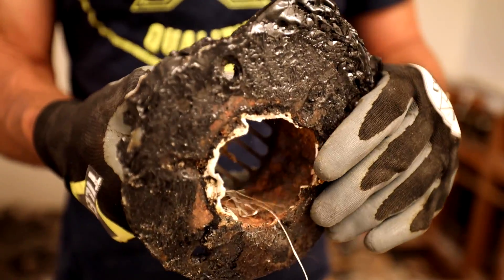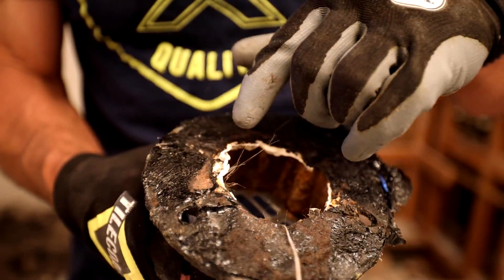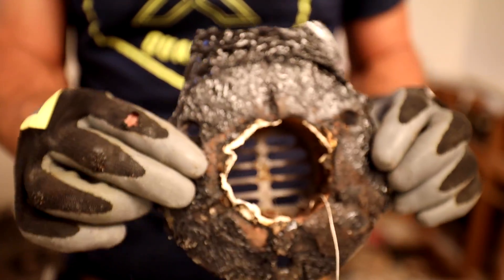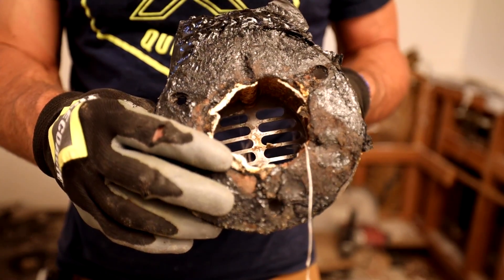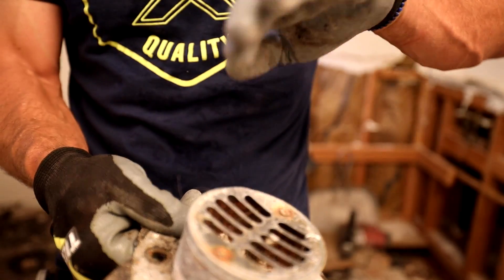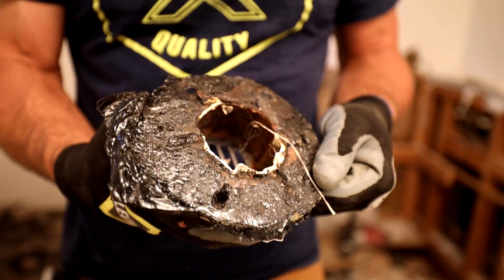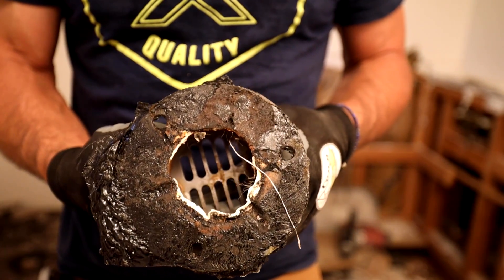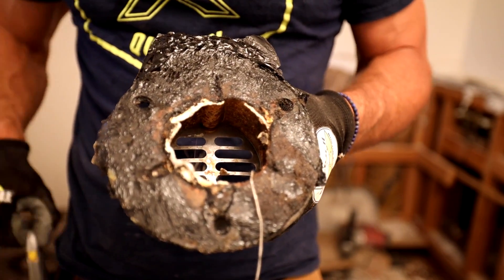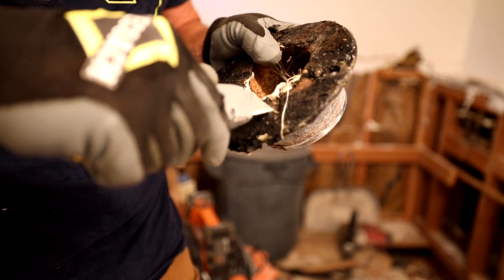Here's the drain — I just pulled it straight out of there. You see there are no weep holes. That's supposed to be a weep hole. When the hot moppers and the tile guys don't clear out these weep holes, the mortar bed just gets saturated and becomes a place for things to grow. And that's when water starts wicking up over the curb — you get cracked tile, efflorescence, cracked grout. The simplest little things. This is something I would love to coach you through if you're building a shower. Don't make these mistakes — this one I can't even punch through because there's so much mortar in it.